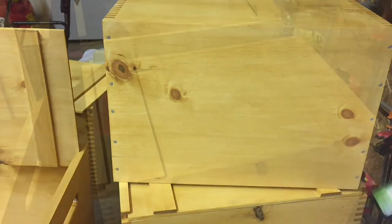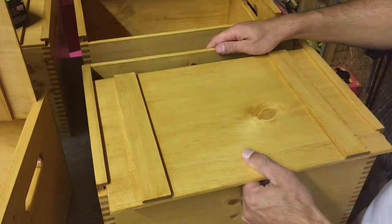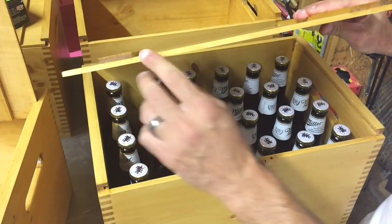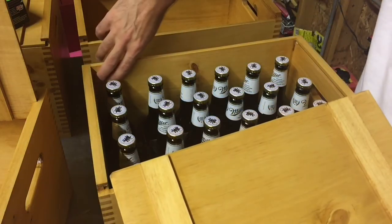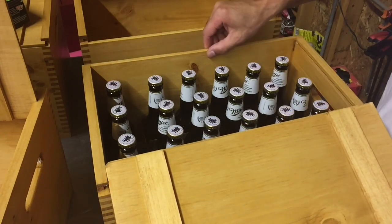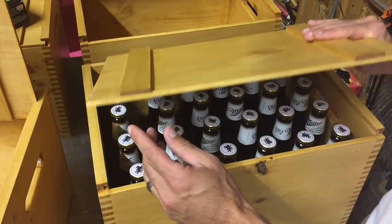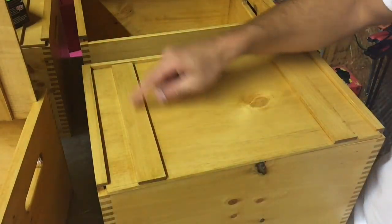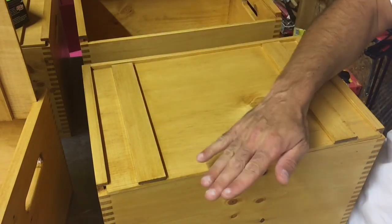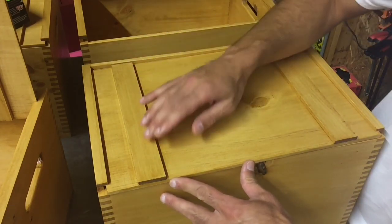On the back, I left a little gap — maybe ⅛ of an inch — so you can get your hands back there to open the lid. On the front, I tried to keep these little strips with a rough edge by using a hacksaw, because I believe originally they used a bandsaw to rip these ¼ inch panels. I love that look, but I don't have a bandsaw, especially one that's 12 inches, so I at least incorporated some of that. They also used to have nails in these little strips and would bandsaw off the back of the nail that came through the lid. I haven't gotten that far yet, but eventually I'd like to do that.